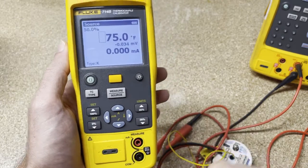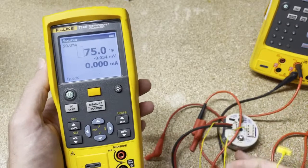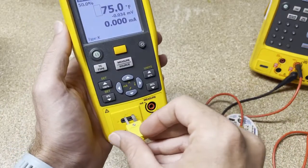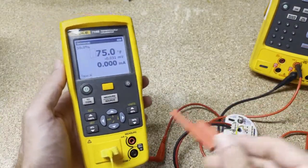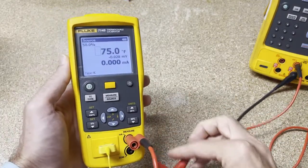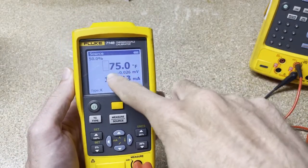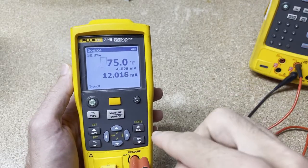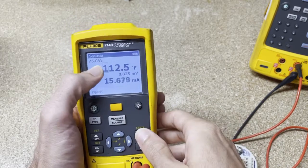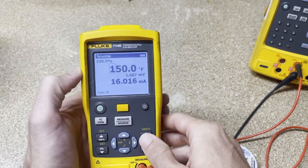Let's hook up the transmitter. We've got our Rosemount HART transmitter over here. I needed loop power, so I have my Fluke 754 supplying loop power, but you could just be in your system as long as loop power is involved. I hooked up the right way on the first try — you can see I'm at 50% and 12 milliamps, which is exactly what we expect for 50%. At 75% between 4 and 20mA is 16mA — just what we'd expect.